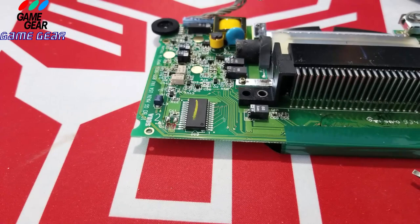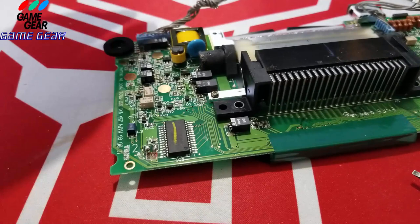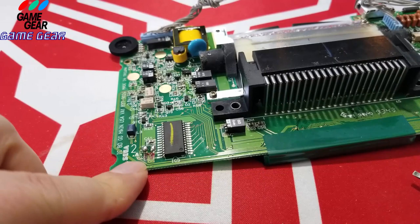All right, just like so. I already cleaned it up. I already took out the legs. I already added some solder. And we're going to cut our capacitor. The negative is on this one. You could see it easily. There's the positive on the left. You could see it from the camera, actually. Right there, to the left is the positive.